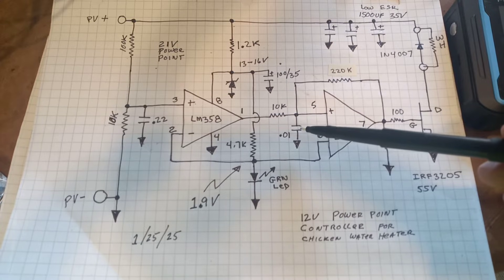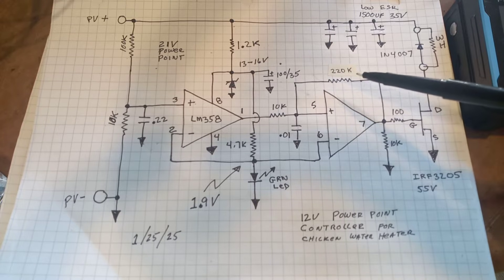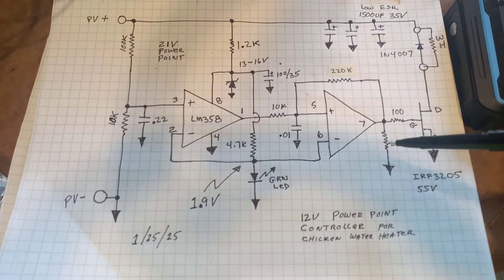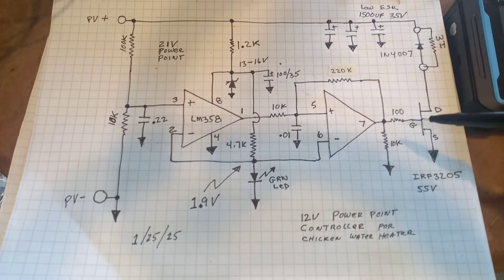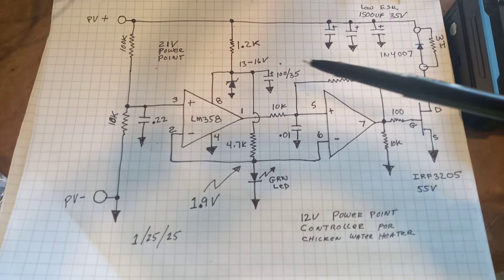Along with this capacitor we have a little feedback here — about 220K. You can go from 180K up to 360K or anything like that. There's a 100-ohm driver resistor for the gate and just a 10K pulldown to guarantee the gate is never floating. You can use practically any diode for this — if you have a high frequency diode that's better, but regular silicon diodes are always fast turning on, just slow turning off. We don't do any fast switching here.